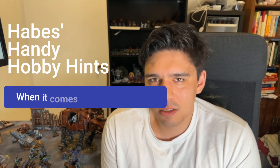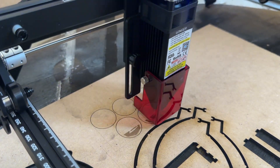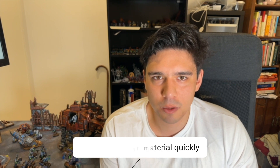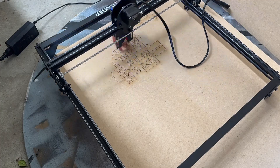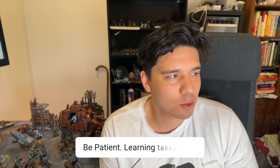We're going to go to Habes's handy hobby hints when it comes to laser engraving — just keep in mind that it is my first week. You really want to maximize your material — strategically place stuff, and if you have leftovers, engrave little tokens and cut them out to use up all the little bits. You'll churn through material so quickly. If you are cutting MDF or similar materials, this engraver can cut and engrave its entire work area in like an hour or two, so you will fly through material if you're trying to pump out stuff. Be patient with it — there's just a lot to learn, and even being a week in, I feel like I'm just scratching the surface. If you want to check out the Longer Ray 5, link in the description. If you want to see my first week with a resin printer, feel free to click that video. Otherwise, here's another hobby video. Thank you for watching and happy hobbying.